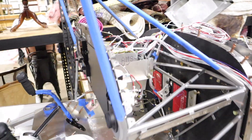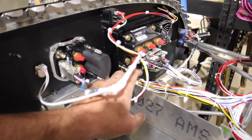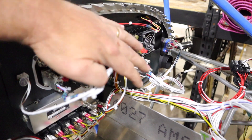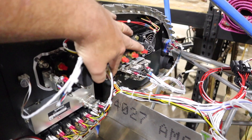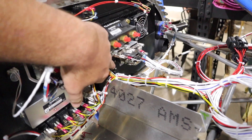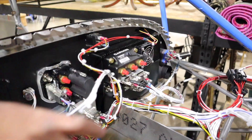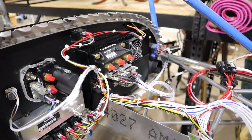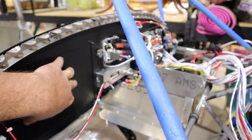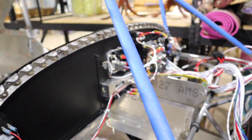It's pretty simple the way that works. There's actually a pin here, so you can mount three GDU460s. There is a serial port behind here — there are two of them. One would go to another GDU460, and the one below it would go to another GDU460. So when we're ready to mount the second one, it's just going to be making a jumper wire from there to here on that serial port.